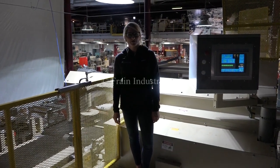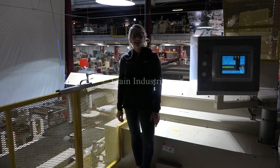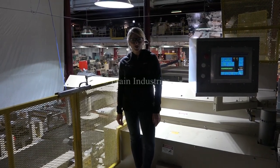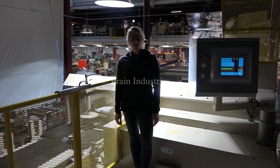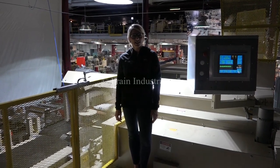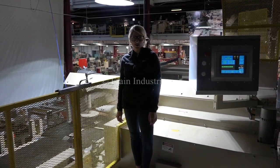Hi, I'm Katie with The Frame Group. Today we're cycling your Slidell Automatic Bag Palletizer integrated with the Lantec Automatic Stretch Wrapper. We recommend you use the manuals in their entirety before powering up the machines. The voltage on the palletizer is three phase 460 volts and on the stretch wrapper three phase 240 volts.